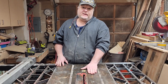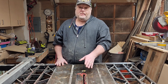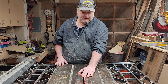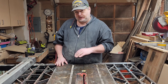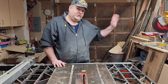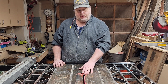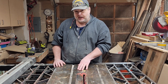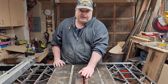There we go — blade is replaced. Relatively painless, actually pretty quick. I went with a 27-tooth blade on this replacement, which is usually about what I run. My table saw pretty much just takes care of all my ripping needs and I use my miter saw for all my cross-cutting. If you use your table saw to both rip and cross-cut, then I would probably bump this up to a 40-tooth blade.